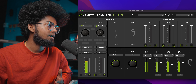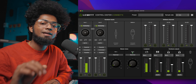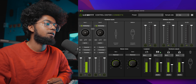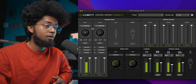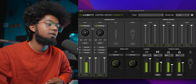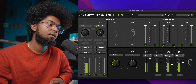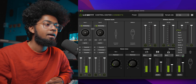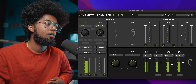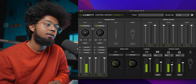For output channels, you can use the master mixes — Mix A and Mix B. With two separate mixes, you can configure them independently. There is also a loopback channel. You can control the monitor level, headphone 1 level, and headphone 2 level individually. There's a mute button, and you have extensive routing options — for example, sending microphone audio to headphone 1 or headphone 2, or routing Input 1 voice to headphone 2. There are a lot of routing settings available, which is a very good feature.